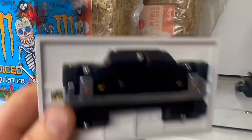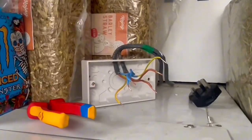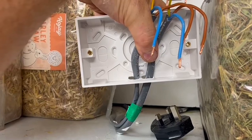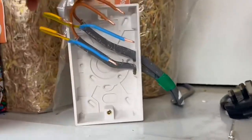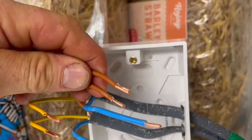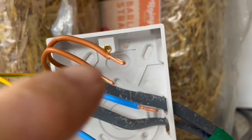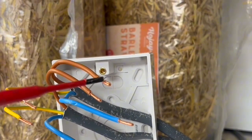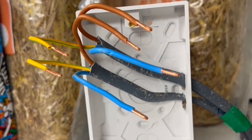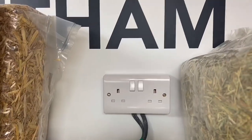We'll put in a click socket. The cable is now coming from the bottom right, so when I fix it onto the back wall it can sit like that. I've doubled back all of the connections. I always double them back this way so that when the screw is screwed down it's going onto the folded-over bit, and the two conductors sitting side by side next to each other give a really good mechanical connection, which makes it a good electrical connection. The socket is now mounted on the back wall, all wired up, cables all doubled back, everything nice and tight.